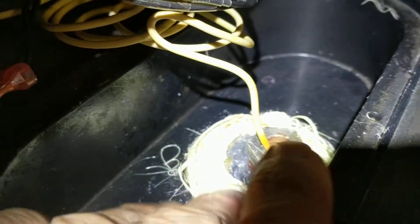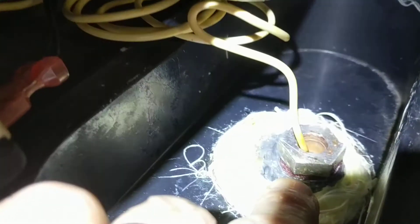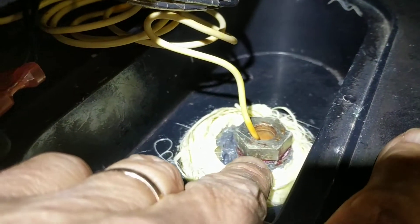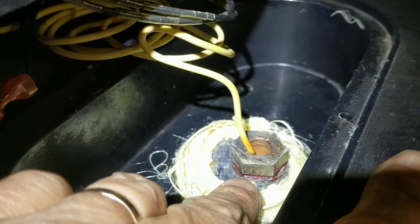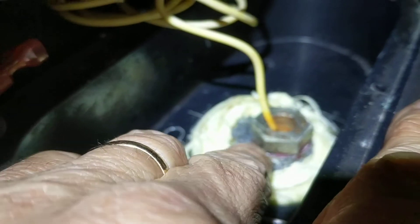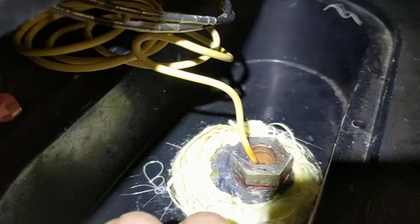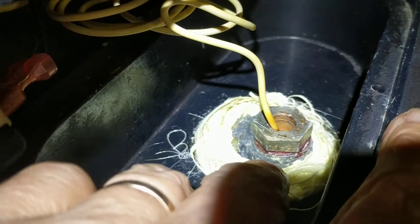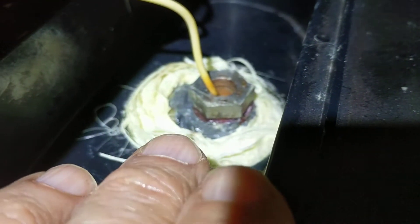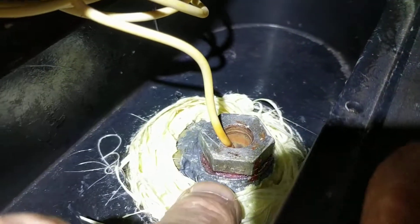From the last attempt, I was still using Teflon tape — I had wrapped it a little bit like a rope. I was thinking of using Loctite 55 but didn't have any. As I was tightening it, water was coming up over the top of the tape. I realized cranking it down might be a bad sign, since I have a crack in the fitting and increasing thread pressure may not be the best choice.